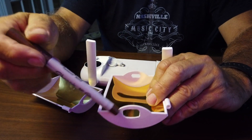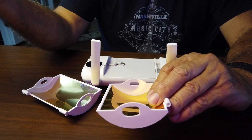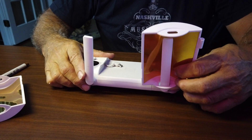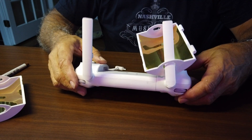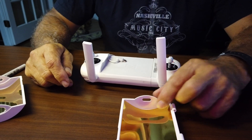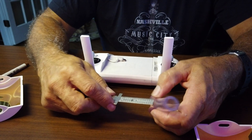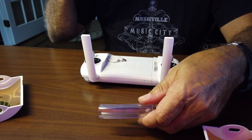You can see that's probably a better example of showing you how to modify that gap right there. So what you're going to have to do is just enlarge it, because there's normally this width here and you're going to have to enlarge it to this width. So once you get that enlarged, they fit on here pretty well. But the problem is that it doesn't reach all the way up to the top, so it's not going to stay on there — it's just going to flop around. This is a half-inch internal diameter tube and I am just going to measure it to two inches and cut it.